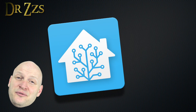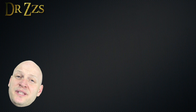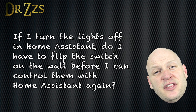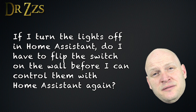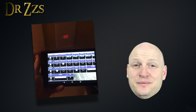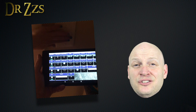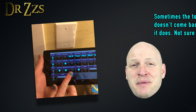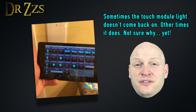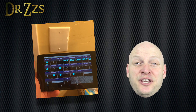Now you'll be able to control these lights from Home Assistant or from the light switch. That's another common question I can answer with this example. The question usually goes something like this: if I flip the switch on the wall, then turn the lights on with Home Assistant, do I have to turn them back off again before the switch on the wall will work? The good news is, the answer is no. A Sonoff with a switch connected to GPIO 14 works just like a three-way switch — it doesn't matter which method you use to toggle the light.